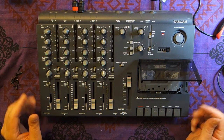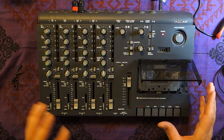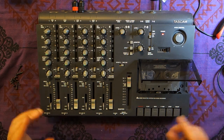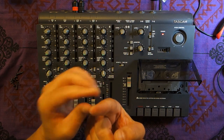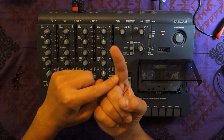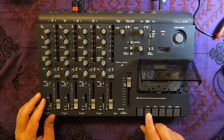So I got this thing working. What I did was clean the capstan roller, but that didn't solve my problem. I tried to adjust the spring — that didn't solve it either. So I decided to take the belts off and discovered that the capstan pin was being held in by the belts. There's a little spring clip that slips over and holds it in place because there's a groove on the capstan. Since that clip was not in place, the capstan pin was slipping down and the gear on the underneath wasn't engaging, so now I've got it working.